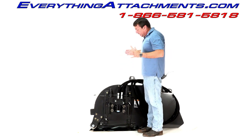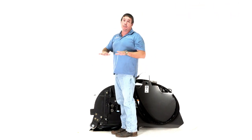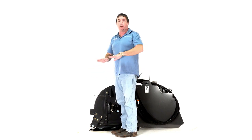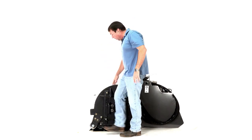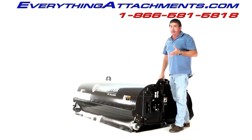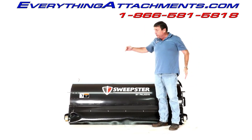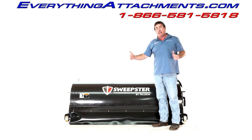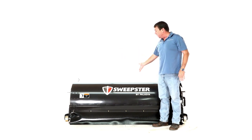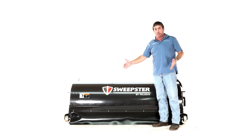The price hasn't changed a lot but the features and maneuverability have changed tremendously. These wheels are steel because the skid steer steers by just sliding, so a poly wheel would wear off real quick — the steel catches all the weight to lift this lid when you're really scraping hard on the road to get the mud up. This comes in a five, six, and seven foot model. This is the six foot. Every size is approximately a little less than 10 inches wider than the broom rating — this is a 72-inch broom inside, but a little less than 10 inches wider with all the mechanisms, hydraulic motors, and everything.